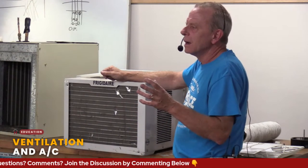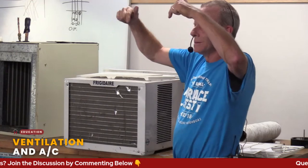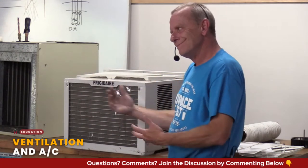But you ever notice, if you don't have air conditioning, nice hot day, and the house may be all right because you don't open the windows, and it feels good until about 6:30, 7 o'clock. And all of a sudden it's like, oh, back to that. That attic is heated up now to what, 120 degrees, and your relatively cool house is at 72, 73, something along that line. What's all that heat going to do? Push right into the house, starting from your attic. So getting that hot air out of your attic, the ventilation side of things, makes it a little more effective as far as cooling that house down.